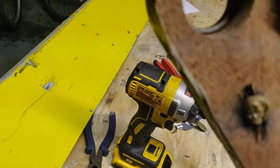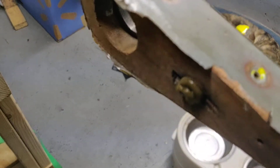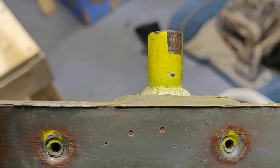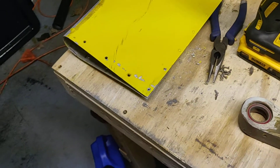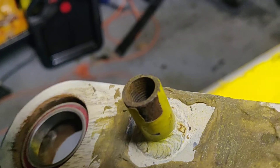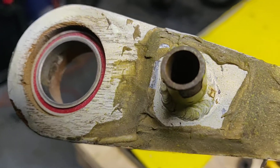This fitting here is just held in by glue — it's just held in by a blob of something. The welding doesn't look horrible, but it's also not really perpendicular to the surface. It's off like 10 to 15 degrees from vertical. It's steel and it definitely does have corrosion — they painted it and everything, but you can see corrosion on that. This is made to take some flight loads, otherwise they would have used aluminum or something else.